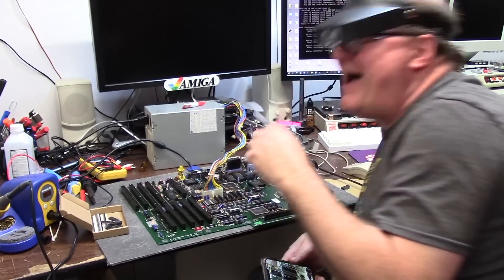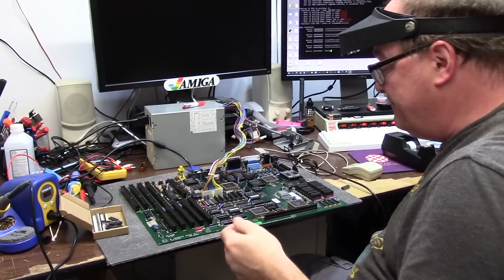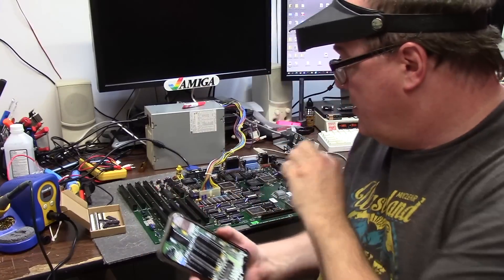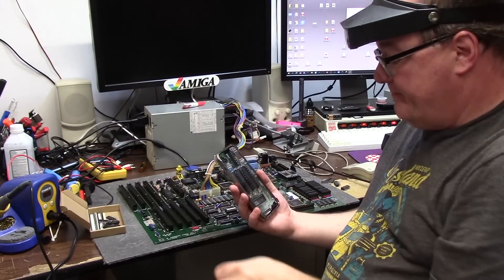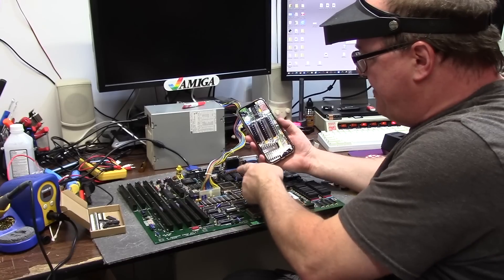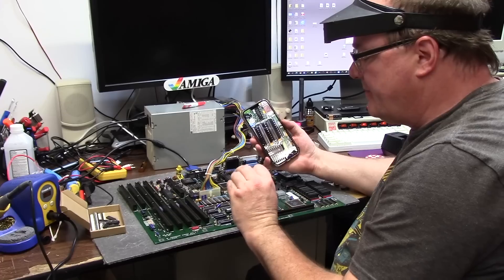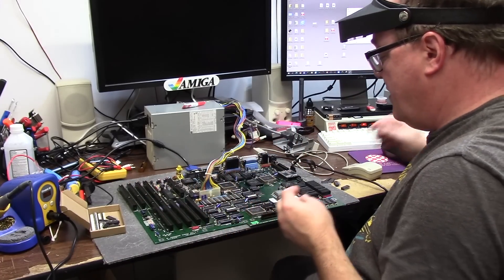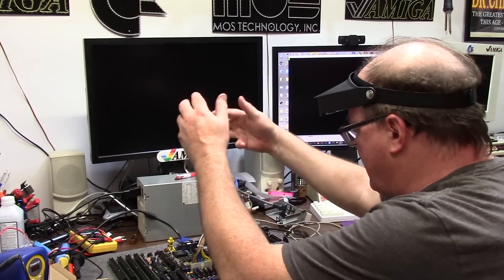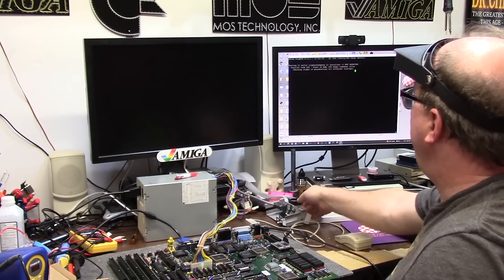I think I put it all in backwards — I put it all in backwards because I'm dumb. The RAM goes with the writing facing that way, I think. Yeah, there's the crystals. So the notch is at the top and the writing is facing away, which means pin one is top left on all these. I'm going to insert these bad boys. RAM is in, power is hooked up, video is on, we have power to the power supply. Let's hit the button and see what we get.